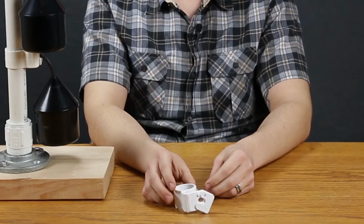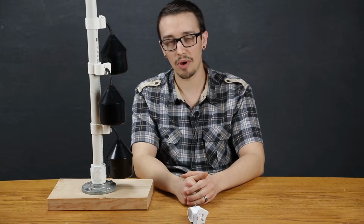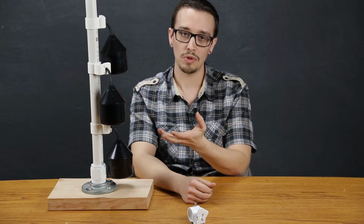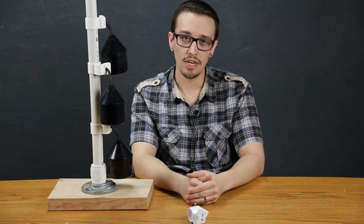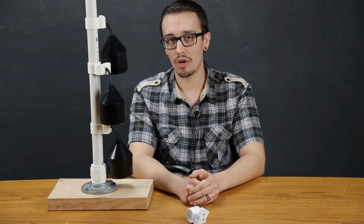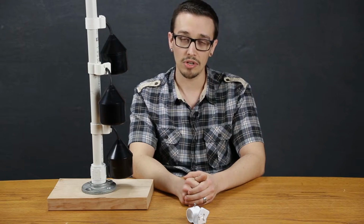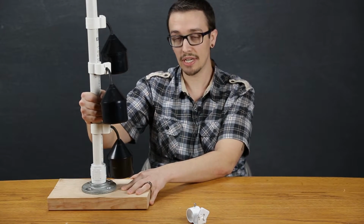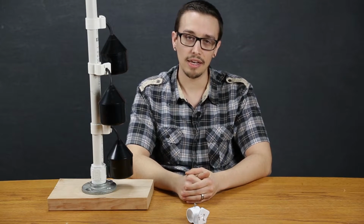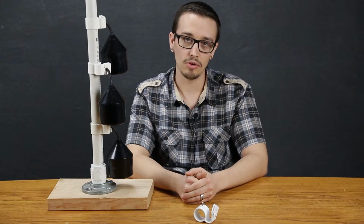And the real nice thing, the advantage of using the float collars on the 1-inch piece of PVC pipe, is that you're able to troubleshoot the floats without having to remove the pump. The most traditional method of attaching floats is quite often to the discharge pipe. When you're dealing with the float collars, you go up to a septic tank or a basin application, and in a lot of cases, you're able to essentially reach down and pull out this whole assembly and bring it up to surface and troubleshoot the floats without having to lift the pump. And, as many of us know, pumps can be quite heavy. So that's definitely one of the biggest advantages of using the Orenco float collars.